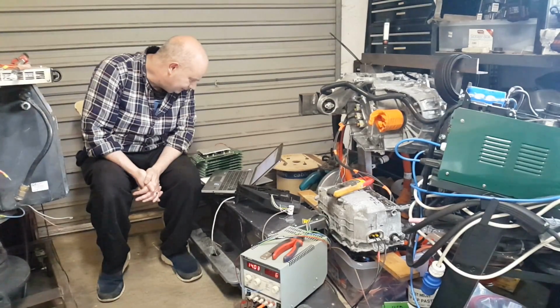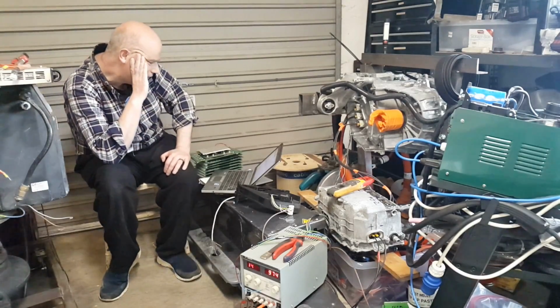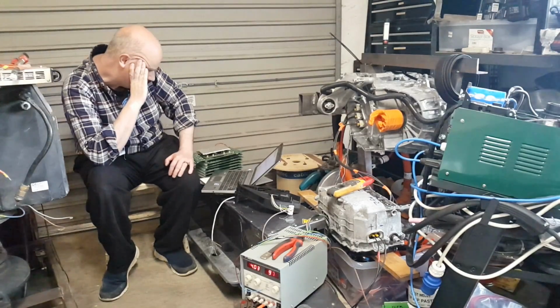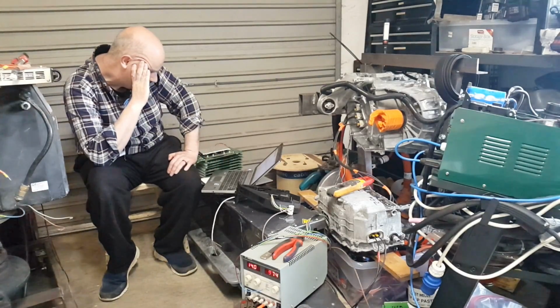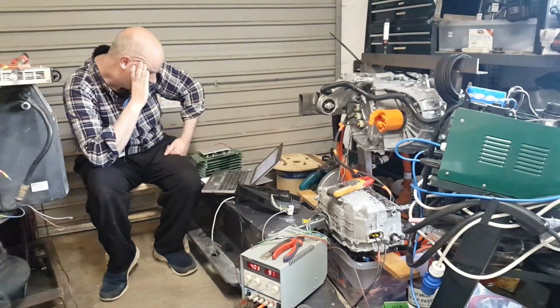Oh, we just got a big kick there, but it's sitting there now. There's virtually nothing going on there. I've got a flat line. But interestingly, just sitting there with no throttle applied, I think I'm going to make a liar of myself. I've seen a few spikes down all the way. It's sitting at a little bit over 350 degrees now, and I'm seeing spikes going down to 0 degrees there. So that's not a good sign.